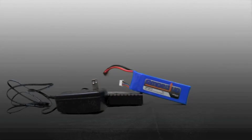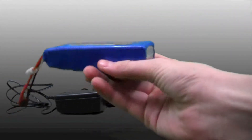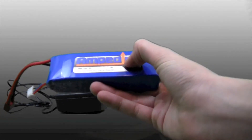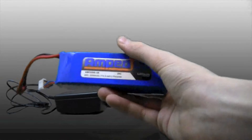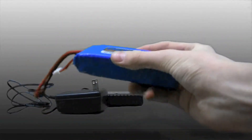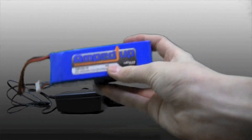So one person asked me: why won't my battery charge? They had a 2200 milliamp battery at 11.3 volts and it wouldn't charge. I just want to say — a lithium polymer battery can never be fully depleted. You have to keep at least 7 to 10 percent charge on it. If it gets to 0 percent, the battery is junk.